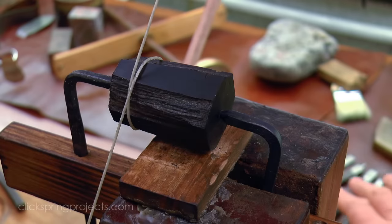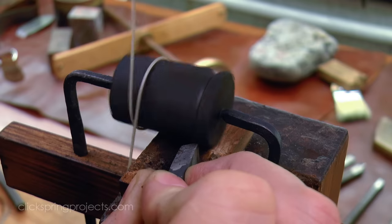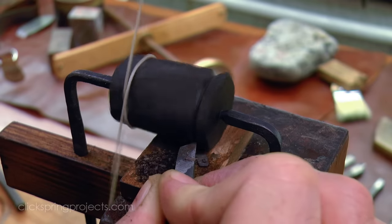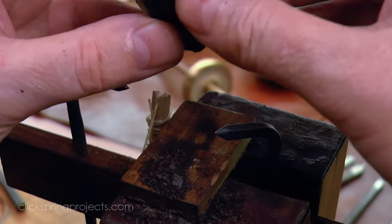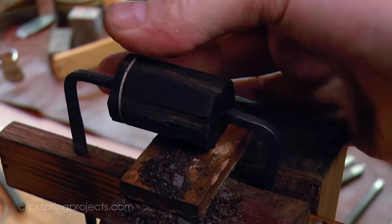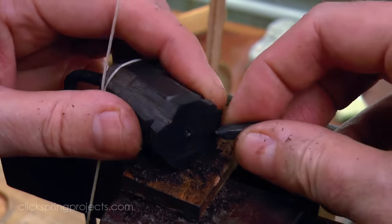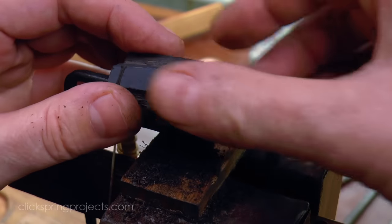The first cuts are interrupted and so a little coarse to begin with. But the great attribute of the lathe is its ability to bootstrap itself into a more capable state. After a light notching cut at one end, the work can be repeatedly flipped end for end, gradually improving the surface gripped by the bowline.